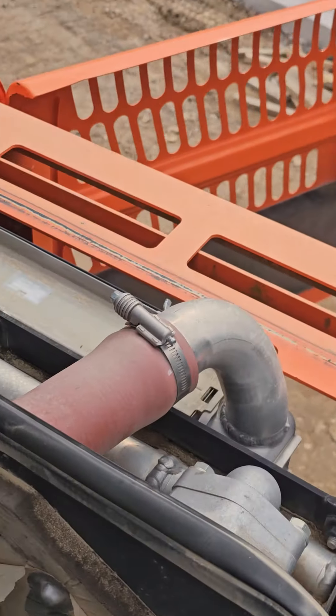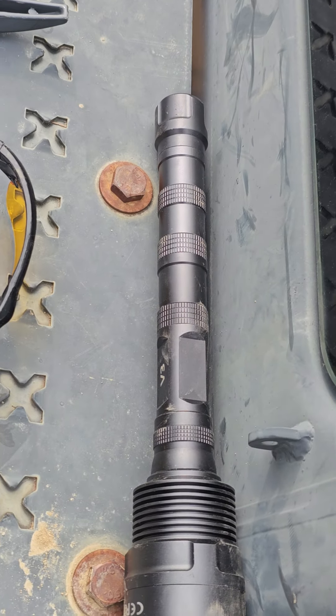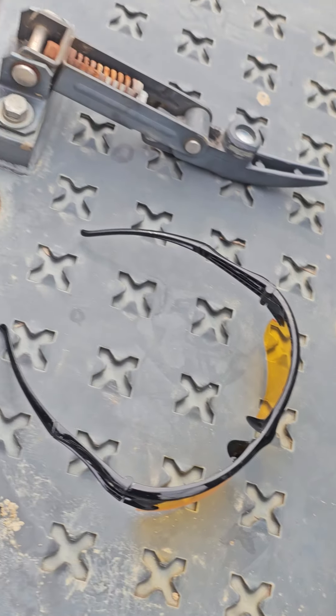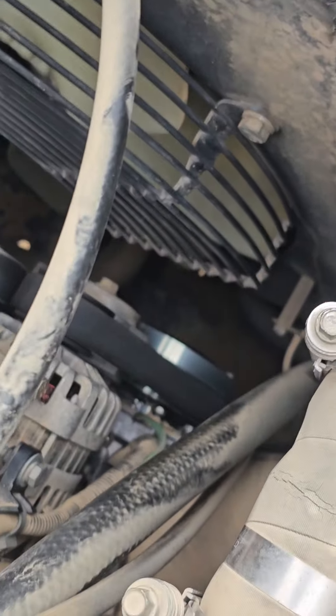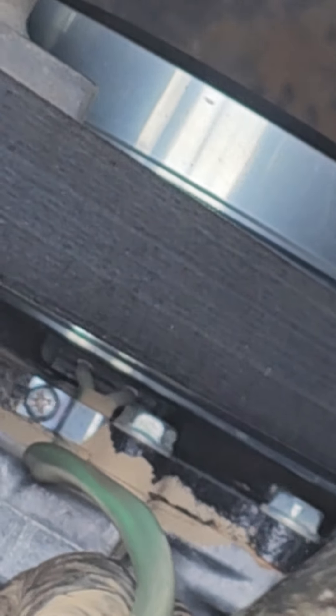There's no audible leak, and this is a $300 ultraviolet light. Even with that I'm not seeing any glowing green, because last time I was here I put a refrigerant dye in as well. Unfortunately, the only place where I'm seeing a glowing green — even though I'm not hearing audible nitrogen sounds — is right there. Unfortunately that is your new compressor. See how it's clean? If you put the light in between there it will glow green, and that's it.